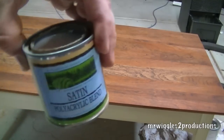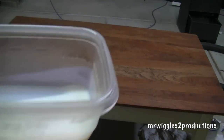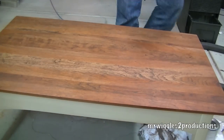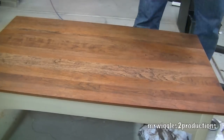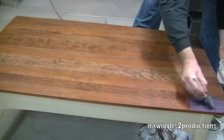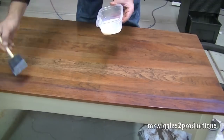We're going to be using a water-based satin poly acrylic blend — I get this at Rockler. It's a milky kind of substance. Normally I would not use water-based polyurethane, but it's winter and I'm in my basement, and fumes are always a problem because I've got a gas hot water tank and furnace. Here's how you basically put it on: you use a foam brush and just apply it with long strokes and spread it on. It actually looks like skim milk when you're putting it on.